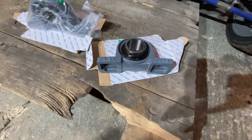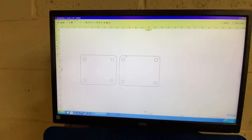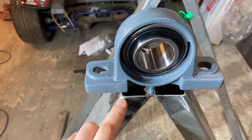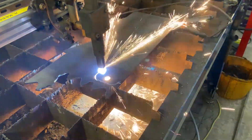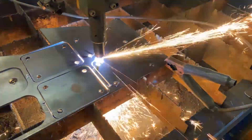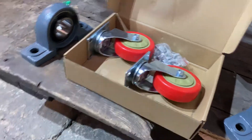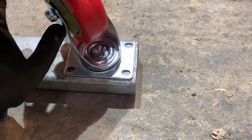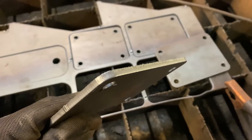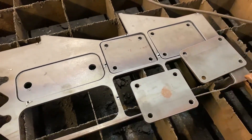The left one is the rear plate and the right one is the front plate — I'll double them up and get them cut out in 5mm. I'm going to put that exactly in the center and make up a plate for that in 5mm again. So there's the bearing mounting plate. Another piece of the puzzle has just arrived and they fit on there quite nicely — two slivers of weld on each corner. That's the four mounting brackets for the shell. Got to love CNC. And then the other bearing block mount — so those little bits are done.